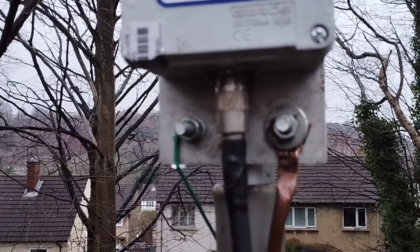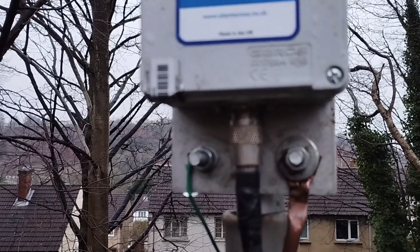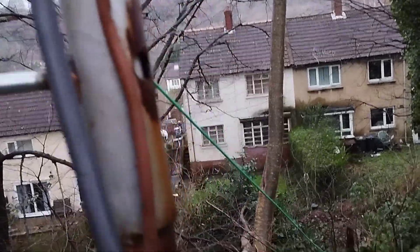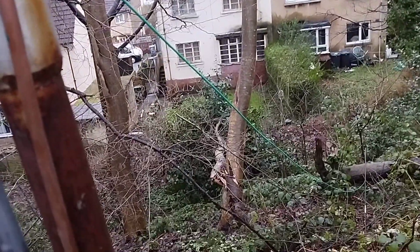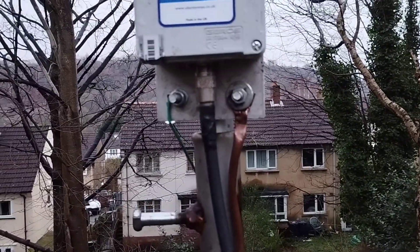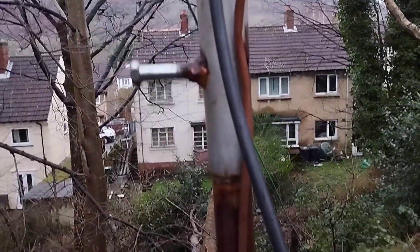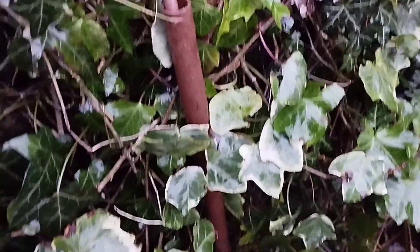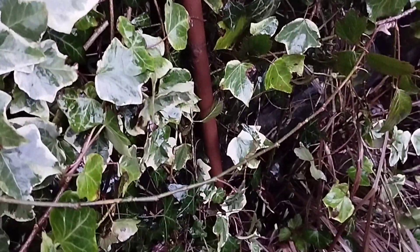The connections you can see: there's the ground which I've fitted, the coax fits in, and then there's a counterpoise. The counterpoise just runs down the hill — it's a steep bit of a hill — and it's 13 feet and 2 inches long. The copper tubing comes down the short mast which is hammered into the ground, the copper bends down and terminates to a bigger piece of copper pipe fixed into the ground.